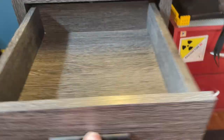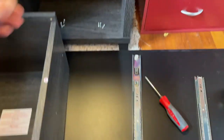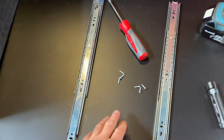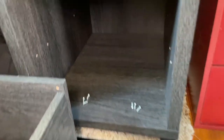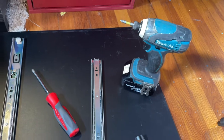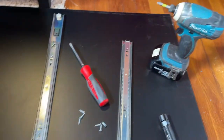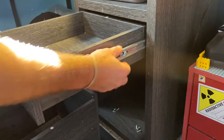There's no left or right — they're the same build. The only way it differs is how you disconnect it on each side from the desk itself if you want to remove the drawer. You'll need six screws for each side — three and three on the sides for the interior, and three and three to attach to the drawer. You're going to need a Phillips screwdriver or a drill, but be careful using a drill impact.